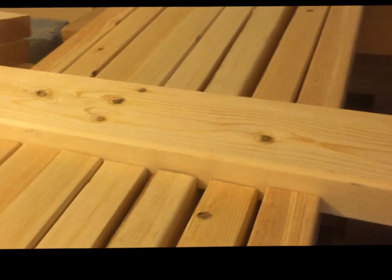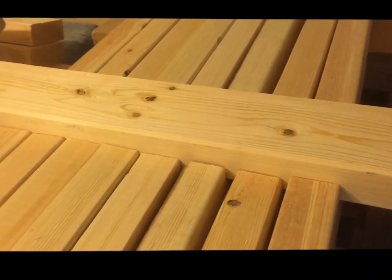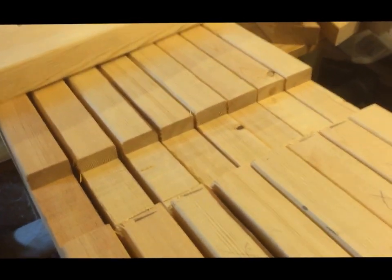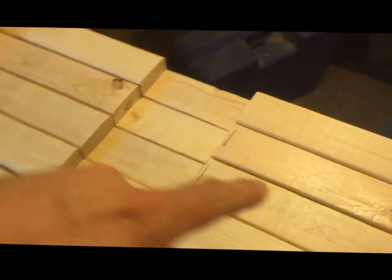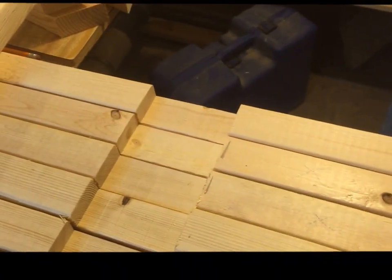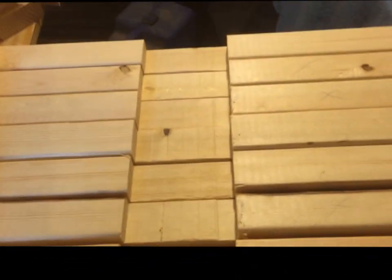So far, as you can see, I only have it notched part way because I didn't want to cut the full inch-and-a-half notch in one fell swoop — that'd be a lot of wood to hog out at one time. I just cut the initial notch the same depth as the shear clamp and chine log at three-quarters of an inch, then I checked the width on all of them. You can see some of these have X's on them with a little line, meaning the 2x4 wouldn't fit, so I didn't cut them quite wide enough. I lined them all up and figured out which ones I need to take some off of and which sides to take it off of.